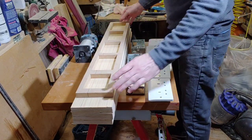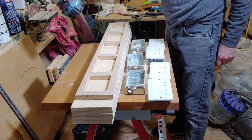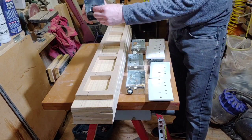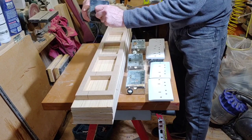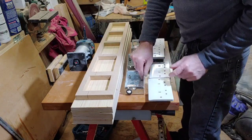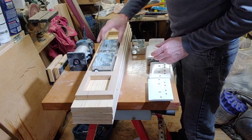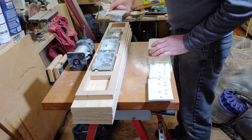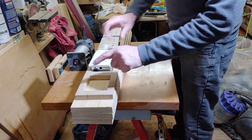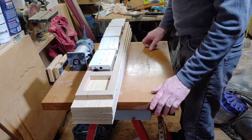Okay, so this is going to sit on the top and we're going to be routering out. Now you will need a router. This is our router. It's a small palm router, and we've got a small quarter inch bit in there. And these are the most important things as well, the back plates that fit in to here like so, and our sockets that are going to go in afterwards. And then this piece at the end is going to be for the mains filter to go in, but this will be explained as we go along.